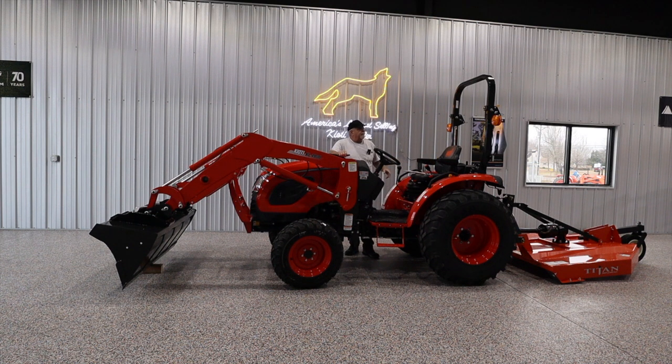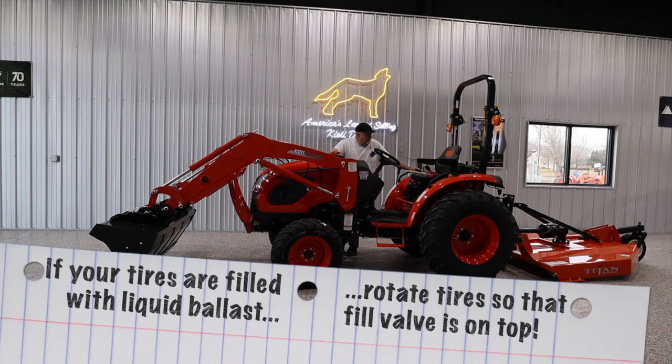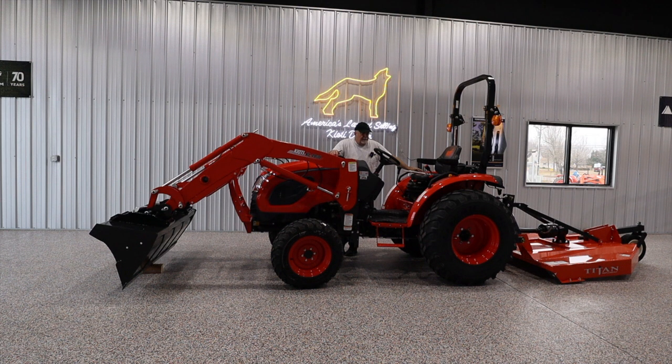It's in the book, and I think this is another smart one: attach a tag. Hang a tag to the steering wheel reminding you of the stuff you did and the stuff that needs to be done before you turn the key. For example, rechecking the inflation of the tires — because remember, you pumped them way past operating pressure, so now it's time to bring them back to operating pressure. Make yourself notes and certainly hang a tag on it, especially about the tire pressure.